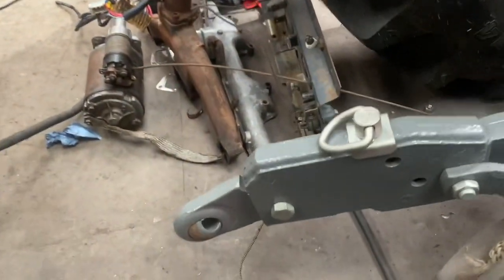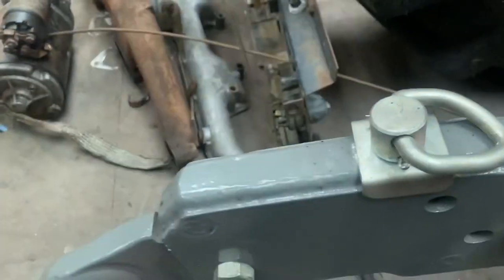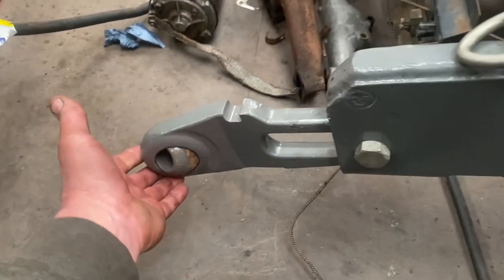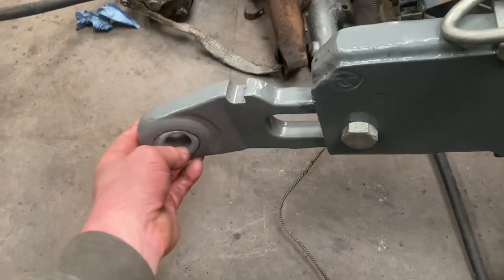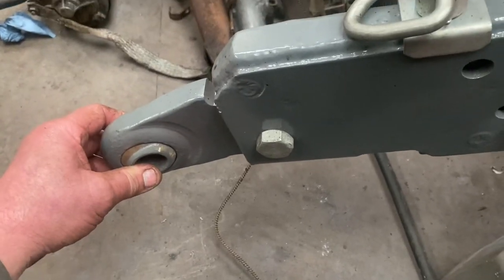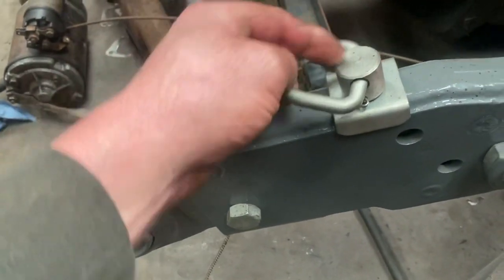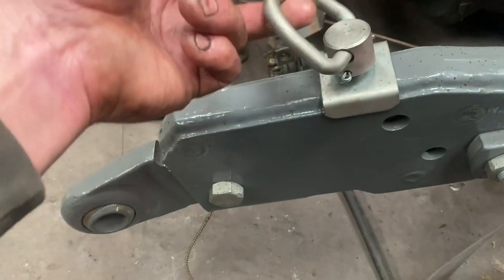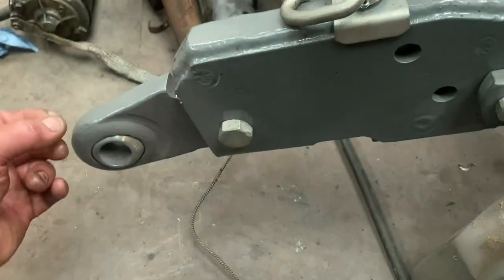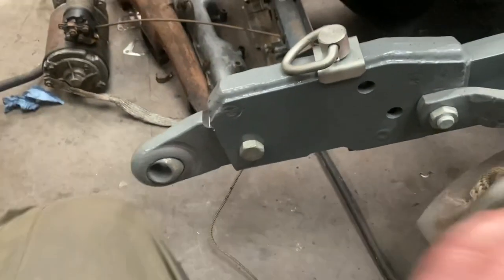Reference the link arms — obviously there's a lever here. They've beefed it up a bit on the 1250, but lift that up and then the extended bit comes out, which allows you to hitch up machinery a bit easier. So you can just get close to it, pull those out, put it on, then reverse back to the implement. That goes in and locks in place. These are a bit more beefy than what the 1200 had — it was just a little plate basically. But they put these big lugs on so you can have a sensible lift. Quite easy to take apart: undo a bolt there, disconnect that, the whole lot will come out, and then there's a spring and a bar inside which locks it in place.